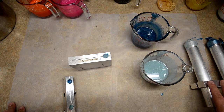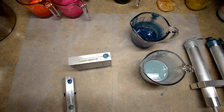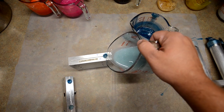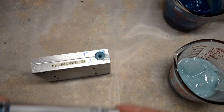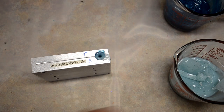The blue has more plastic so I'm going to use that to top off the sprue - it's pulling down extremely fast, so I'll just sit here and keep an eye on it. Always make sure you oil your o-rings and your injectors - it makes it a lot easier. Sometimes you have to do it in between every couple of injections, sometimes you don't. I'm also using the vacuum pot to degas and get air bubbles out of the plastic. It's a longer process: heating everything up, getting everything to the same temperature, removing air bubbles. Let me show you the blending block real quick before we open it up.